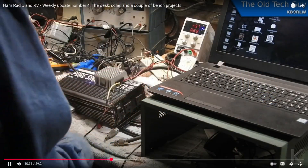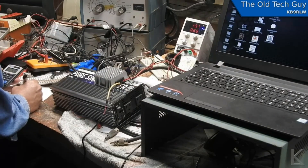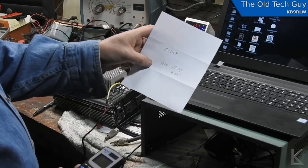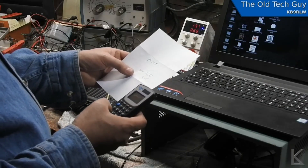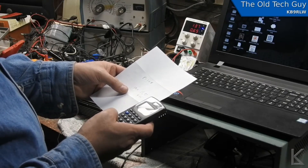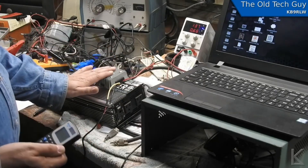When I first built out the RV, I did a test comparing a direct DC-to-DC converter with using the inverter and the supplied power supply. The result: running the laptop through the inverter used 15.87 watts, while going directly to 19 volts used 9.25 watts — that's 58% of the power, a savings of 42%.